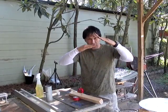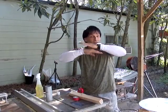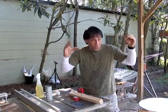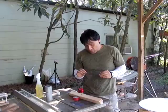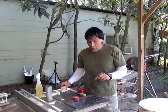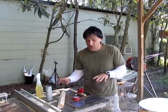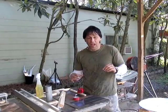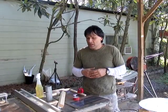Also, you want to make sure that your cells overlap in order. You don't want to have one cell be the bottom of both — that would totally mess things up. So you want to go one on top of the other, just like you would stack batteries in line. This builds your voltage. In a future video, I'm going to show you how to finish the wiring and how to seal a panel with an air gap using regular glass and silicone — it doesn't require any fancy expensive resins, and there's a little trick that keeps the condensation out.